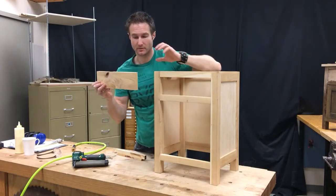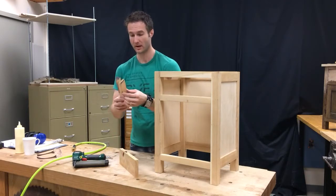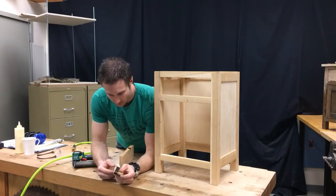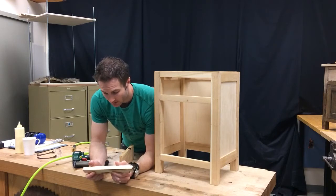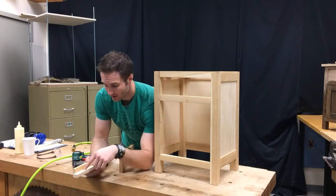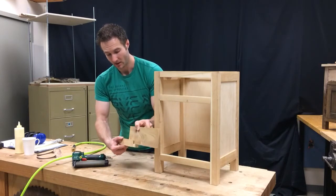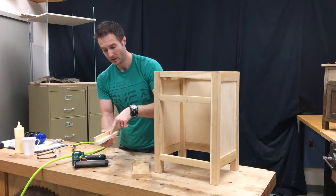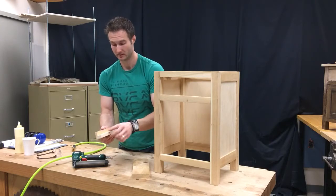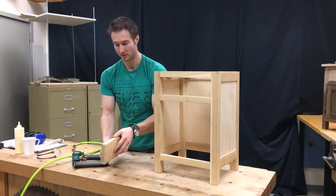Once you've got your two sides dressed to final size, we need to actually make the lower drawer guide. I've got this one out — this is Trenton's. I just want to show you exactly what it is before we install it. This is the lower drawer guide. The drawer actually rides on this surface here — imagine this being the drawer riding on this surface. These two pieces are glued up; it's just a simple glue joint, but the lengths are different. The side piece here is important because it makes sure that the drawer doesn't rack — so it doesn't fall off its track.